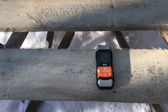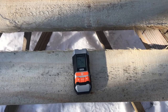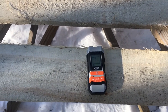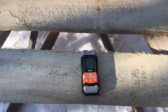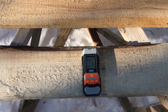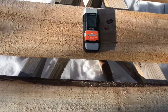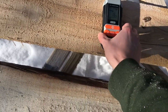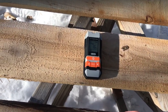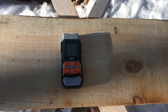On the ash right now it's reading about 14%, and this is supposed to be plus or minus 4% accuracy. Poplar coming in at 11%. Hemlock is 16%, and the white pine is coming in at 11%.